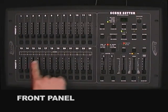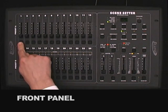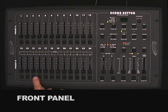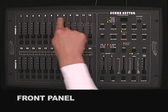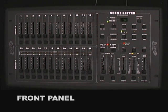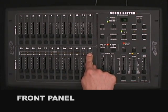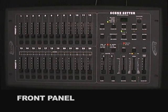Channel faders 1 through 24. These 24 faders are used to control and/or program the intensities of channels 1 through 24. Bump buttons 1 through 24. These 24 buttons are used to bring the selected individual channel to full intensity. The 24 green LEDs. These LEDs show the current intensity of the relevant channel. The 12 amber LEDs. These LEDs light when the relevant scene is active.